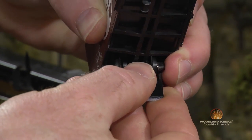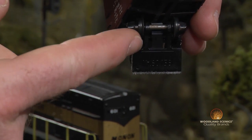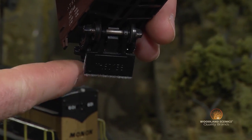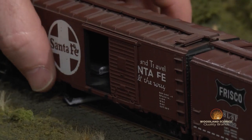To ensure the dust monkey fits properly, you can do a quick test. Simply roll the axle away from the dust monkey and the dust monkey should remain immobile. If at any point the dust monkey is binding, simply file the outside edge of the hooked arms or wherever it may be binding.